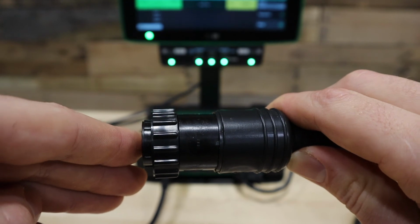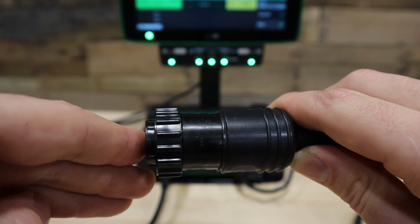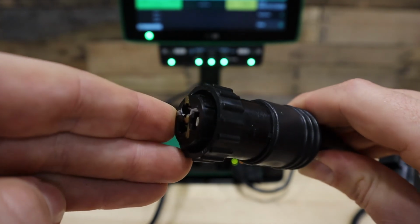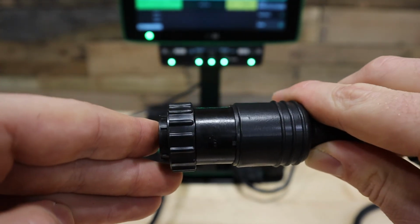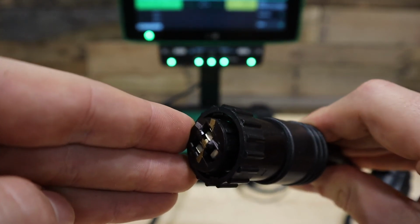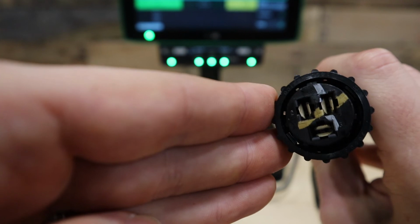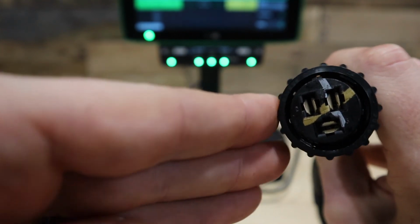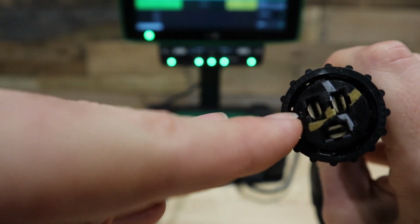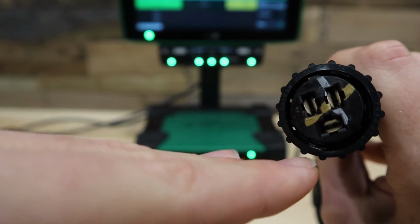If you do not have voltage on both the switched and constant pins in the connection going to the DBM, trace the power harness to the convenience port outlet to verify voltage at this connection as well. We will be describing this step looking at the harness going to the DBM. You will need to check voltage on the connection coming from the cab of the tractor. In this case, looking for between 11 to 15 volts, take your voltmeter and check from the vertical pins, which are both the battery and switch power, to the horizontal pin, which is your ground.